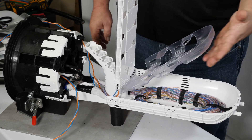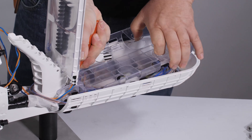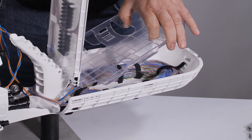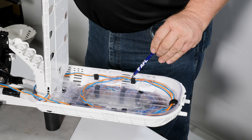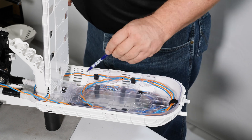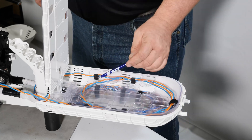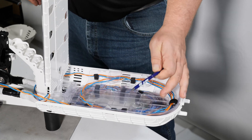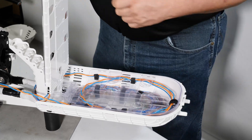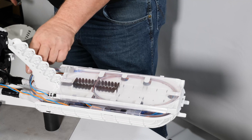Lock the inner basket in the upper position. If the inner basket needs to be removed, simply disengage the mounting pins on one side using a sheath knife or similar tool, then rotate the inner basket to disengage the second mounting position and remove. Fibers and tubes routed to the inner basket are secured similar to the lower basket with velcro or tie wraps in multiple locations. Verify that fiber or tubes are secure with enough slack to raise and lower the inner basket without pinching fibers or kinking tubes. Check all slack under the yoke and adjust as needed, then prepare to secure fibers or tubes in the splice tray.